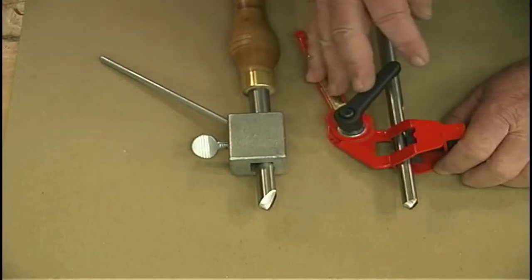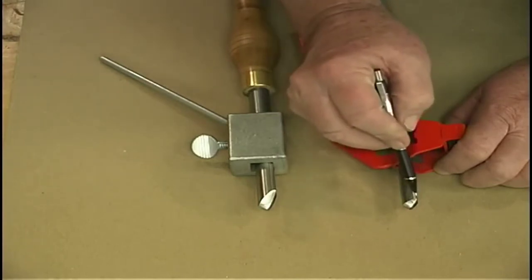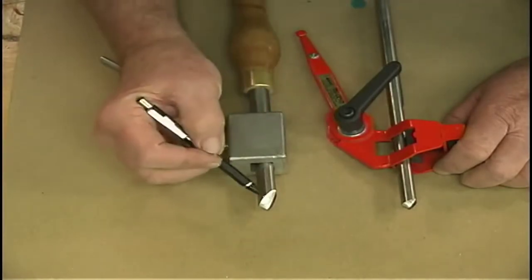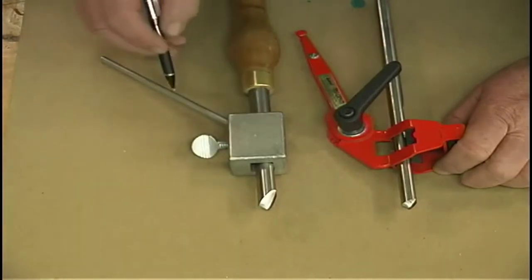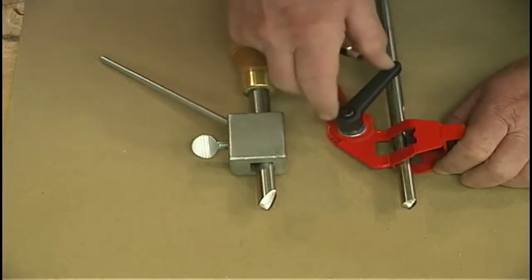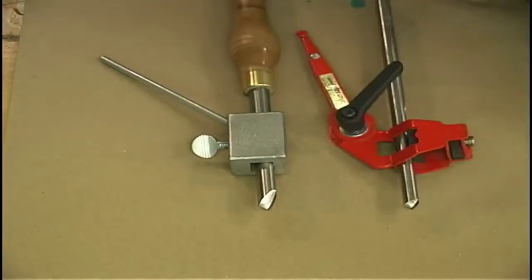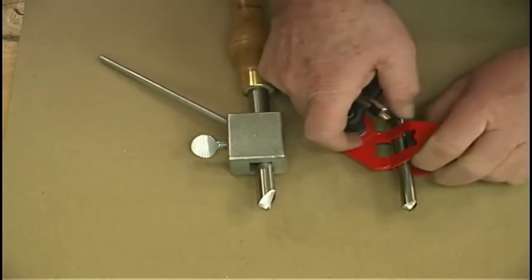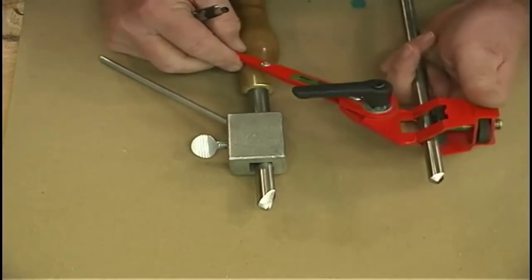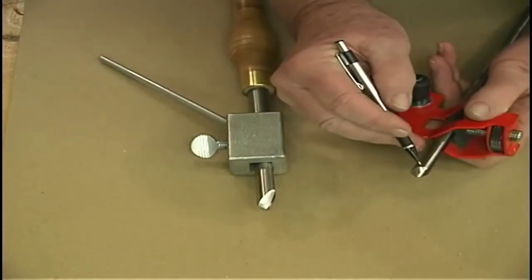When I set this jig and adjusted the leg, what I did was pull this ear back. With the Ellsworth jig that is fixed — if you'll notice how long this ear is, and also look at the angle between the arms. If I wanted to make this grind with this jig, or even with this one, what I have to do is loosen and bring this jig arm forward, which will present a much greater roll and bring this back farther.